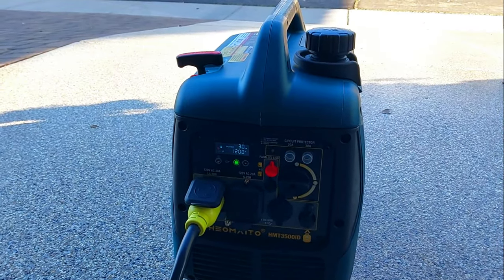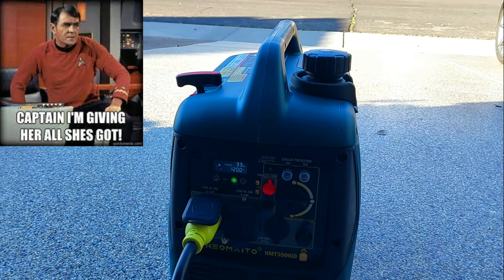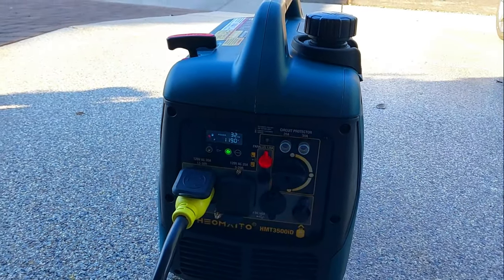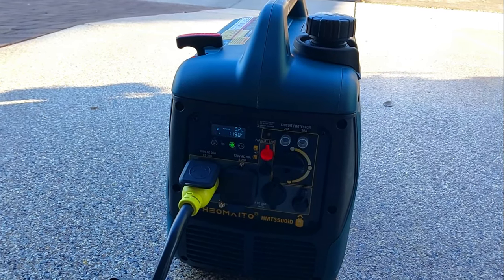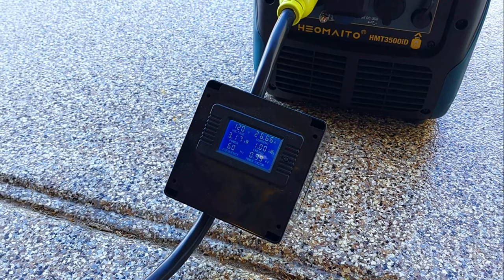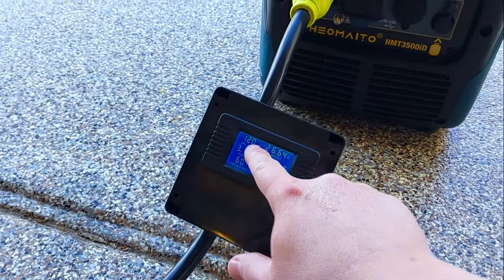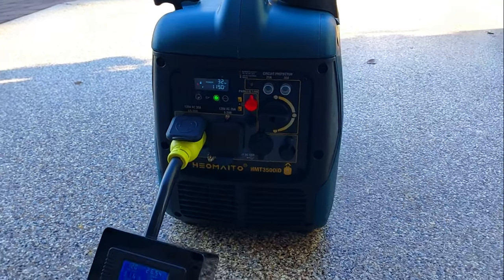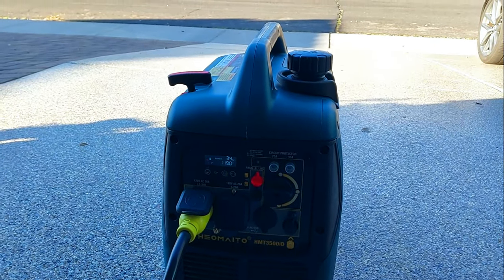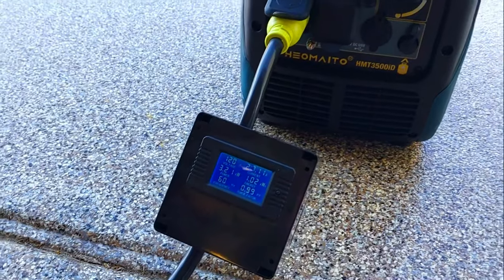All right, I'm going to add in some additional load. Let's see how far we can push this guy. Another 200 watts. We're just getting a little bit of clipping. Just flickering a little bit. I assume that's picking up a little bit of a square wave. That's 3.2. 120 watts. Add a little more draw to it. At 3.4, we're definitely flashing. Interesting, this shows 3.2.